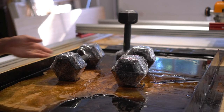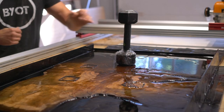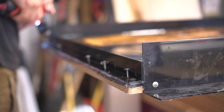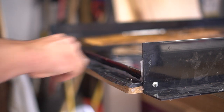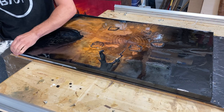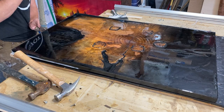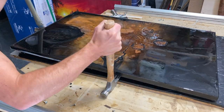We waited over 48 hours for this to fully cure because it's thick set epoxy, which cures much slower than regular epoxy. With regular epoxy poured this thick it would actually start smoking and bubbling due to heat - this is a chemical reaction and heat can be generated if you use too much at once, so keep that in mind. Even though we have a plastic barrier below, it might take a bit of time to pry it up slightly, but a hammer or two will take care of the vast majority of your needs.